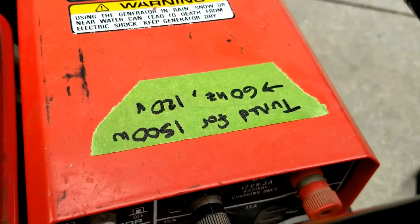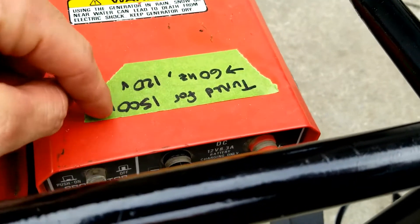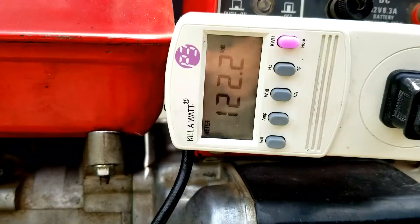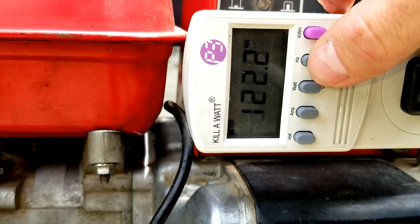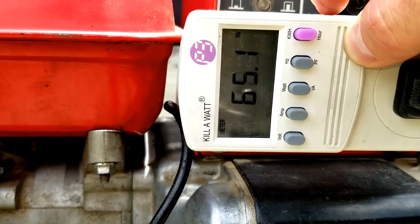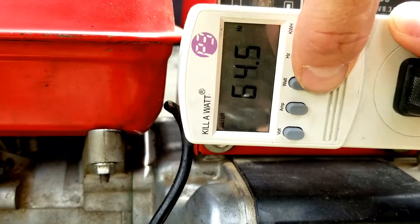For instance, I have this tuned for 1500 watts, which when I put a load on there at 1500 watts, the Hertz are then about 60 and 120 volts. Alright, I have my generator here at idle speed right now — 122 volts, 65 Hertz, bouncing in between there.